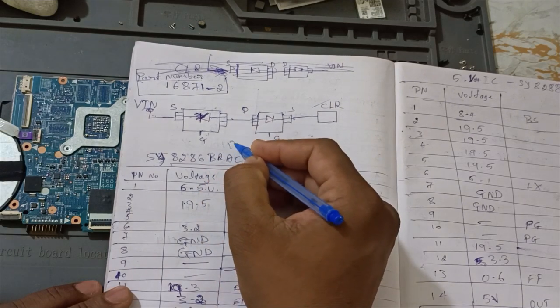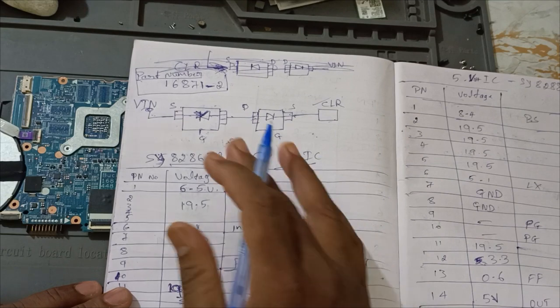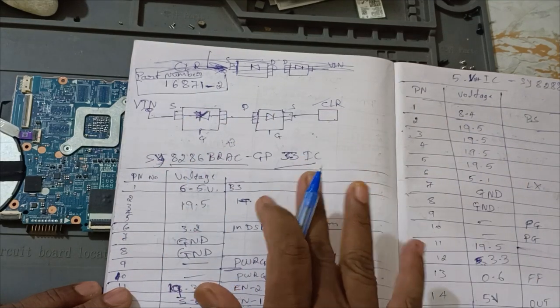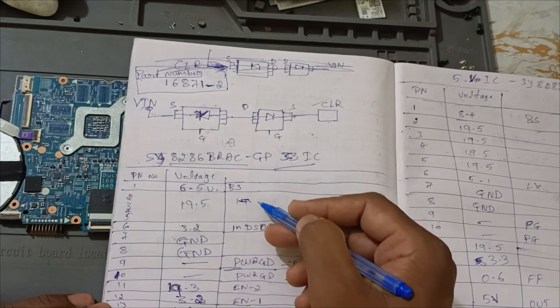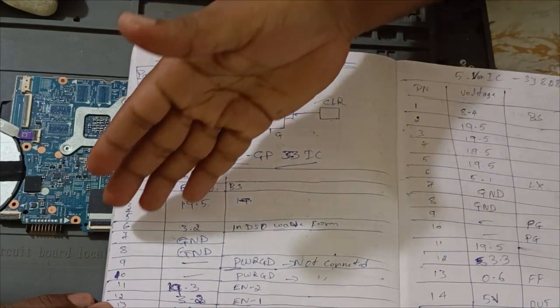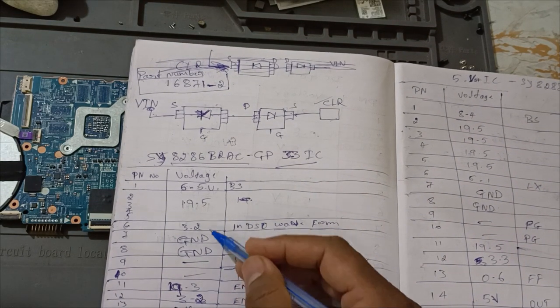That six leg small IC will be there. Through that you will get the gate. Okay, just in generally you have checked, right? See, this is the 3.3 volts IC. So IC pin LDO 3.3, good. Enable also present. Yes, sir.